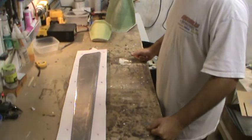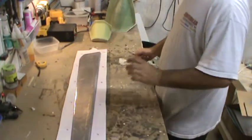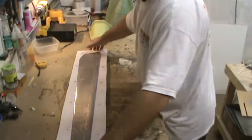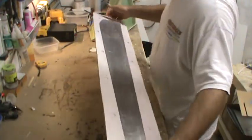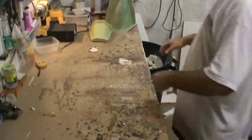Unfortunately I put the PVA on a little heavy, so around the perimeter of it it's still wet. I'm gonna let that sit — I was hoping to get that layup done tonight, but because it's still a little wet I'm not gonna do that. So let's put that aside.